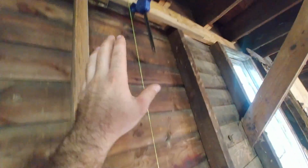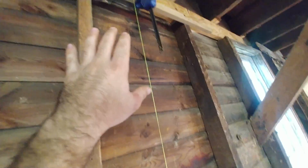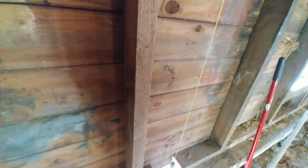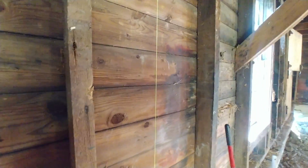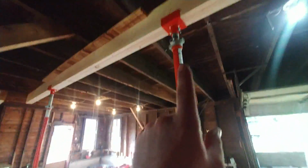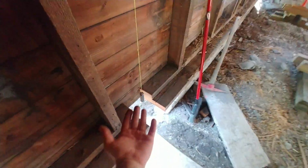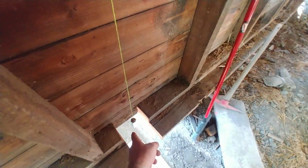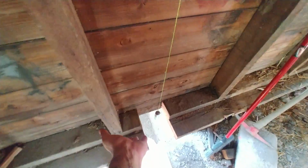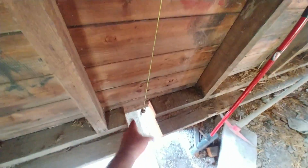So now the post is stacked in from bracket to concrete footing, and it's attached to the beam up there, and we've squished the wall back up again so that all the matched lumber seams are tight, and we've nailed them all to that. And then I could probably pick it up in here again, and the post will come right off that footing down there a hair. I'll just be sure that it's not going to drag, and then I'll get around the post with the machine and I'll drive away,